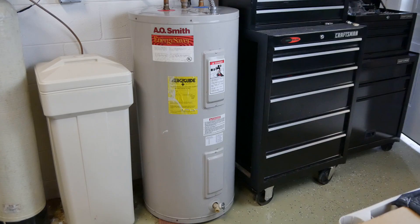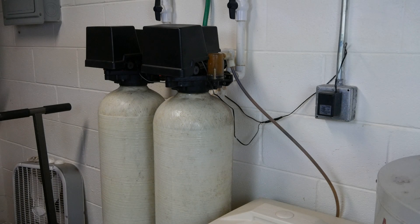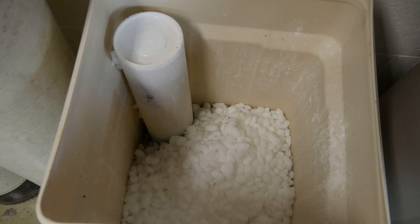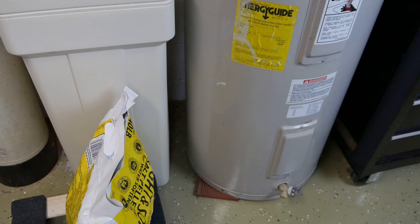This video pertains to my electric 40-gallon hot water heater. I have a whole-house carbon-based water softening system which uses salt pellets to backwash the water on a timer every three days. So why does my water still smell? Because water softening has nothing to do with the minerals that attack and attach themselves to the anode rod inside the hot water heater. Additionally, those smelly sediments can settle at the bottom of the heater, and that creates the need to drain the water.